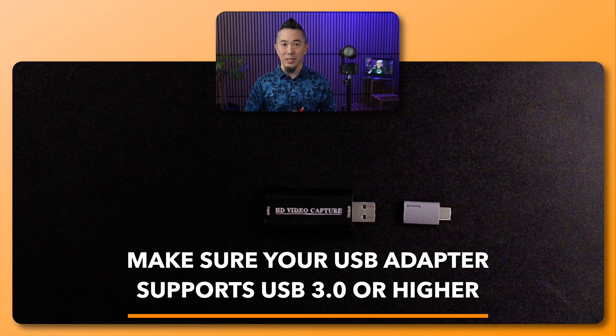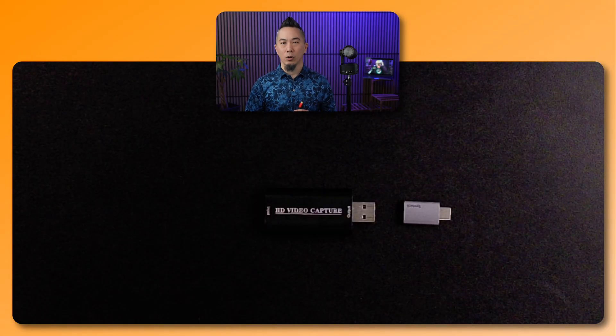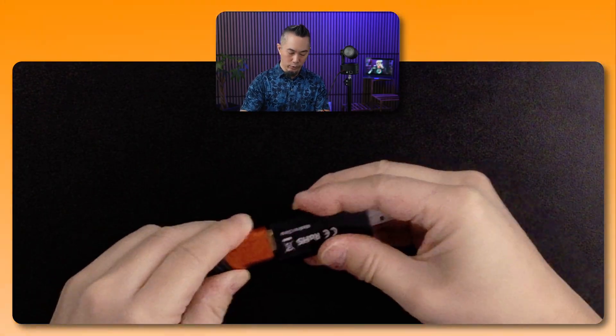To use the HDMI output and capture it into your computer you'll need an HDMI capture device to convert the signal into something your computer recognizes. Options include a cheap $20 HDMI capture device with a USB connection, the popular Elgato CamLink 4K, or any compatible USB capture device. If you're short on USB-A ports you can use a USB-A to USB-C adapter. One end of the HDMI cable connects to the back of the Tail 2 and the other goes into your HDMI capture device.